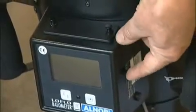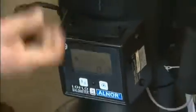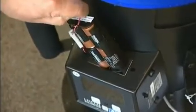This control device has a switch on the side of it. The screen comes on to show the flow rates. It has a control for the direction of the air flowing — you can change whether it's supply or exhaust by pushing this button. There's a little arrow on the screen that points up or down to indicate which direction the air is going. There are also three scales for what the CFM is going to be, and it'll automatically pick the right scale and adjust as needed. It'll give you a digital readout as well as an analog on the graph. This is powered by four C cells inside of the box. Be careful to make sure that you turn off the device so it doesn't get bumped and wear out the batteries between uses.